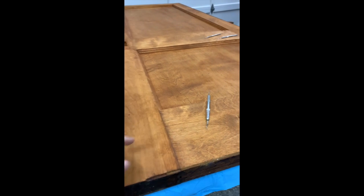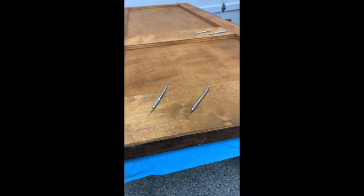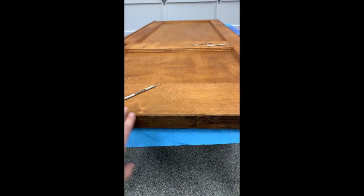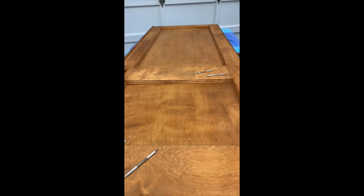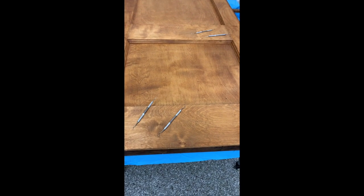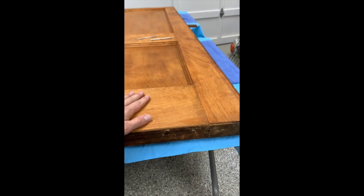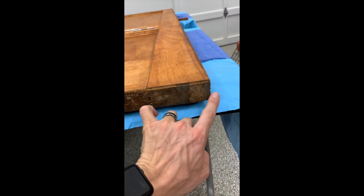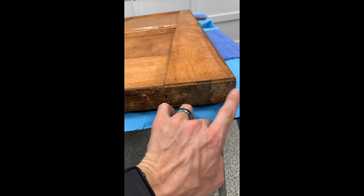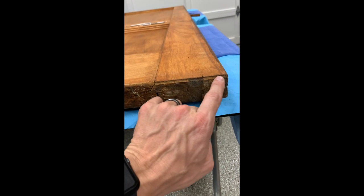As I was going around cleaning up some of the corners of this door, I thought it was interesting and something to point out. Realize this door is original to the home — the home was built in 1913. The craftsmanship of how they would have made this is remarkable. It's a fairly large door, about seven and a half feet tall and roughly 32 inches wide. It has what I believe to be a maple veneer, and from the underside of the door you can see how it was actually constructed — almost a tongue-and-groove series of pieces of wood with the veneer placed on top.